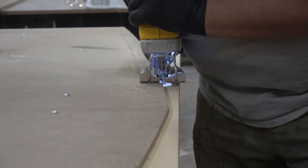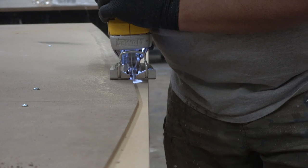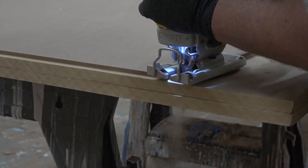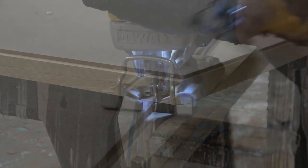Now that we're back at the shop, I've got two 4x10 sheets of MDF that I screwed and glued together, and now I've got the template screwed to it. I'm going to take my jigsaw, and I'm not cutting it out exactly — I'm going to cut as close as I can so that my flush trim bit can come in next and get a perfectly flush edge with that.